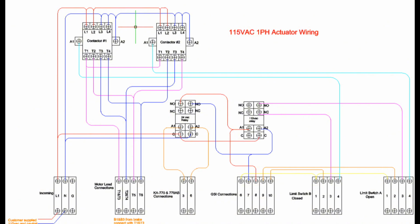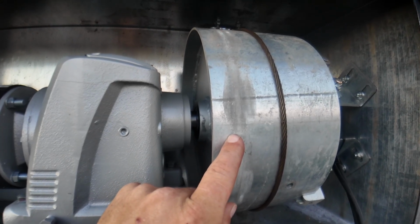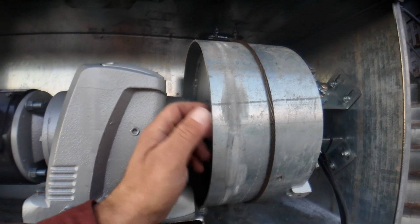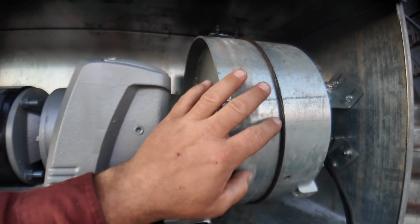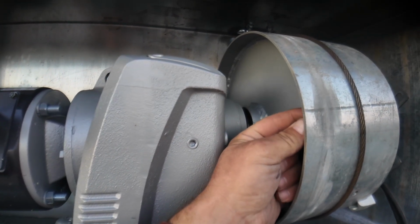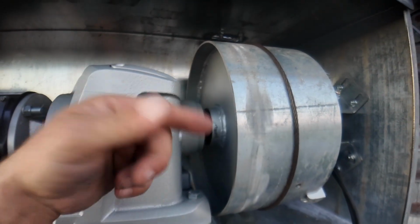Normally what we would do is drill a hole in this drum right back here on the edge, put about 2 wraps of cable on the drum with the chutes down the whole way. You want at least 1 wrap of cable on the drum when the chutes are down. You drill a hole right in the edge, about a 3/8 hole, put a cable clamp on the cable in here, a wrap of cable before you pull the chutes out.